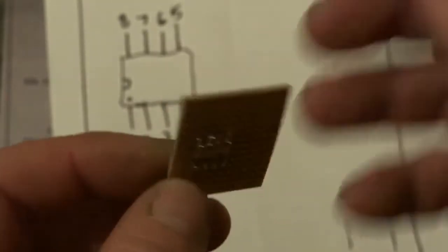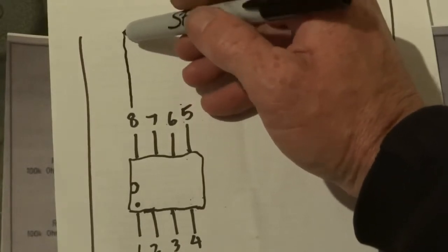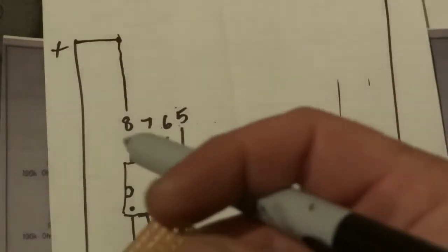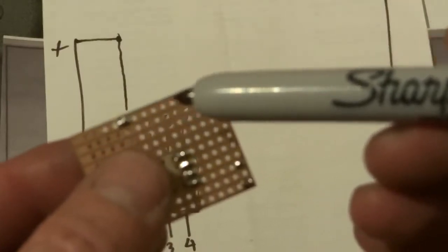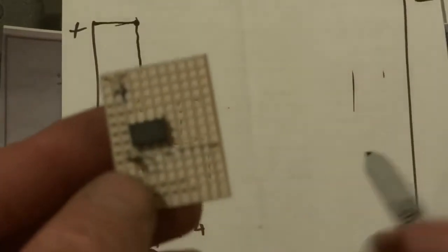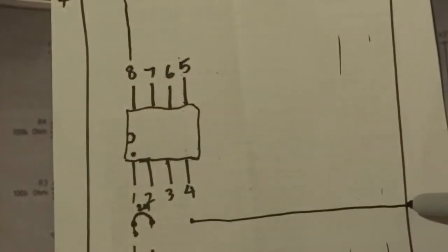Then what you do with the pins that you chop off on the bottom — you'll need to connect from number eight, so the track that comes off up the top. You need to connect the pins that you cut off to the furthest track on this side, as that will be the positive. The track that runs down here will have the positive, and the one that runs on the other side will be the negative. Use wire to go from there to there, and from number four you want a pin that goes from number four to the negative.